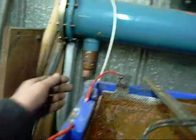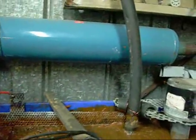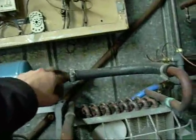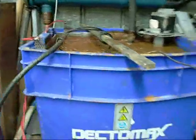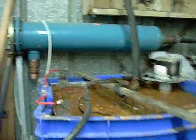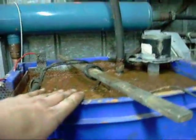What I've got to do is attach onto here, which is the inlet for the filter canister. There's a stainless steel filter running along the inside, going through to the discharge on the inside, and then out through this cooling coil, cooling fans, and back out into the tank. The most important thing is the check valve. When this system shuts down, I don't want water flooding from inside here back into the tank and overfilling it.